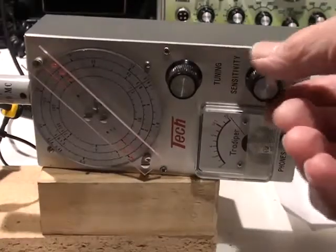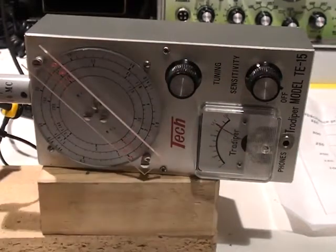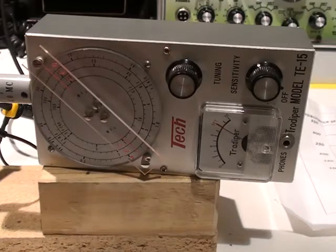The dip oscillator is switched on at the moment. Here's a better view of the dip oscillator — I'll just turn the meter down, and you can see the little needle there. The idea of this dip oscillator helper is that I can now swing the tuning capacitor knob until I get a dip.